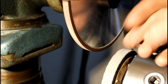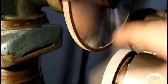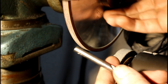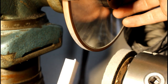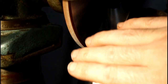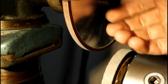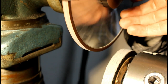This and diamond wheels. So I'm abrading it away using this old grinding wheel held in the power head. Once I've abraded this resin bond away enough to where I'm getting contact around the entire circumference, I'll then take a dressing stick and clean this wheel out. What this will do is remove the bonding material that's holding those CBN particles. It'll cut that back a bit and expose some fresh CBN particles and allow this wheel to cut freely. But right now I just want to get it to where it's true all the way around and making contact around the entire circumference. That's the idea anyway.